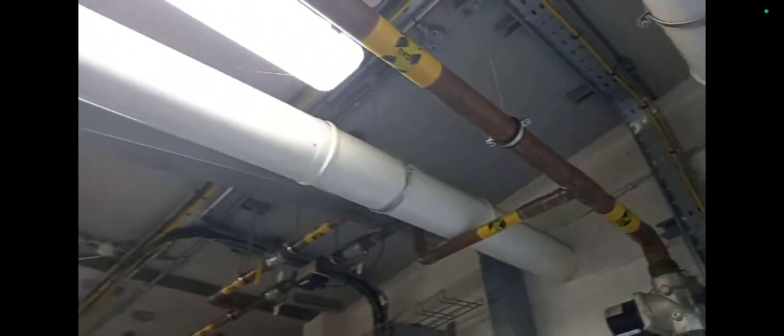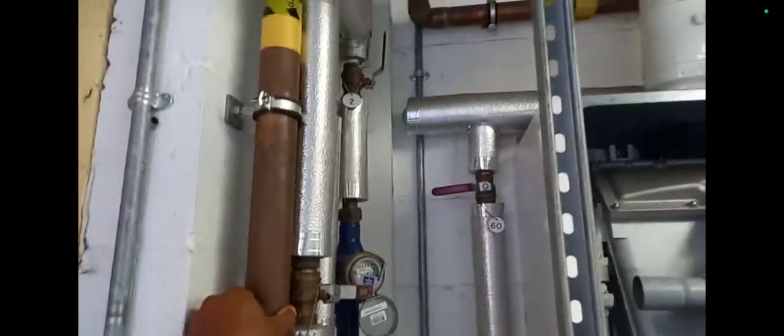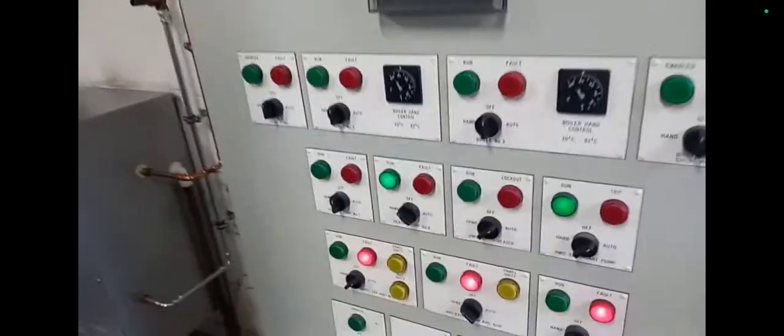So it's the gas pipe, solenoid, and the flue run. Just making sure it's clipped. Sometimes you've got to give things a wiggle because a clip can be there but it doesn't mean it's actually doing anything - flues can dislodge and come out of their pockets.